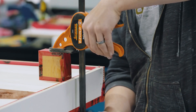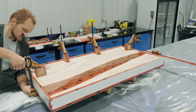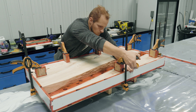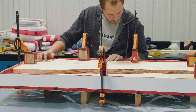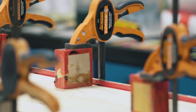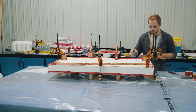The mold is finished, and now it's time to clamp down your boards. Your wood pieces will float in the epoxy otherwise, so this keeps them flat and in place. It's really important that you don't screw the slabs from underneath. All epoxies experience a small amount of expansion and contraction during the curing process, and the slabs could pull apart if they aren't free to move a little — that's why clamping is best. Ensure that the form is level and as leak-proof as you can make it. It's also a good idea to put down a piece of poly below your mold, to ensure any blowouts end up on the poly and not on your floor.